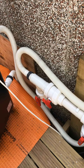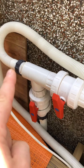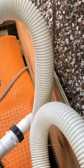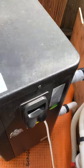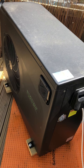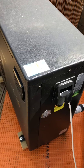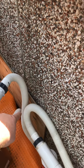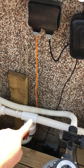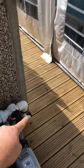As I am using the heat pump and it is plugged in, I've twisted this valve so water can't get through that side. The water comes through and goes down this direction, through into the water inlet here. Water gets forced up into the heat pump, which does the deed of heating the water based on the surrounding air temperature — currently giving around 3 degrees increase. It comes back out from here, down this pipe, round and up here. Because that side is blocked off, it continues forcing out in that direction and goes back through.